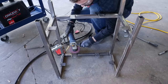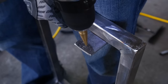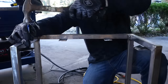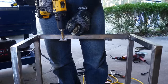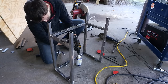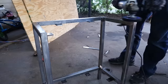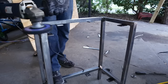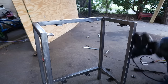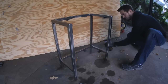They're going to be underneath, so they don't have to be super pretty, but I went ahead and cleaned them all up. I used a punch on each tab to make a mark so I could drill a hole with a stepped bit, and I sprayed each one with WD-40 to keep the bit cool while drilling through the steel. With all the holes drilled, I flipped the frame over and countersunk the holes from the bottom side. I used a stripping disc to clean off and even out all the finish on all the surfaces — it's more for taking off paint and rust, but it gives a really cool brush finish. I went over the whole thing with a couple of coats of spray poly.